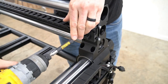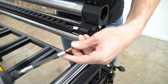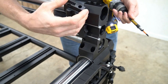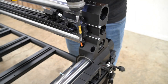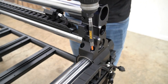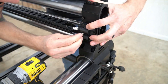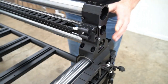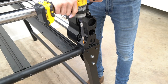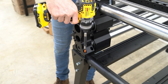At the end of the X-rail opposite the motor, there is a bracket for the Z2 wire coming out of the drag chain. You can use a 4mm hex key to remove the bolt holding that in place, then move the drag chain bracket out of the way to more easily access the X-rail mounting holes. We'll use the bolts from the included X-rail mounting hardware and a 5mm hex key to secure them in place. Once our X-rail is secured, we can place our drag chain bracket back where it was and use the bolt and 4mm hex key to secure it. With the X-rail bolted to both our Y and B gantries, we're going to place one bolt in the inside corner of both the Y and B feet, creating a pivot point that will allow the machine to self-square.